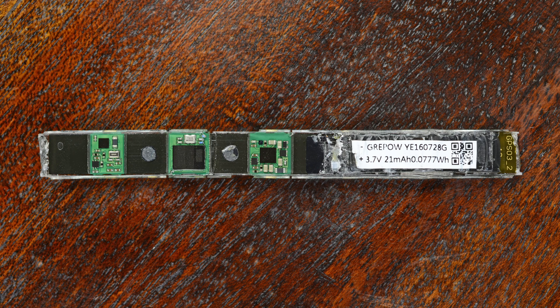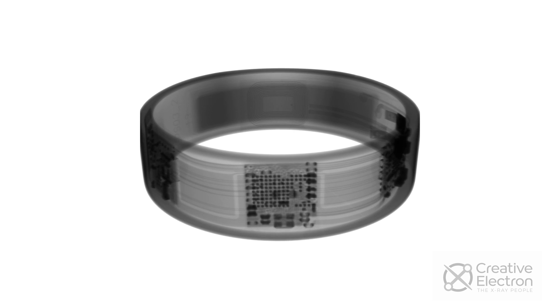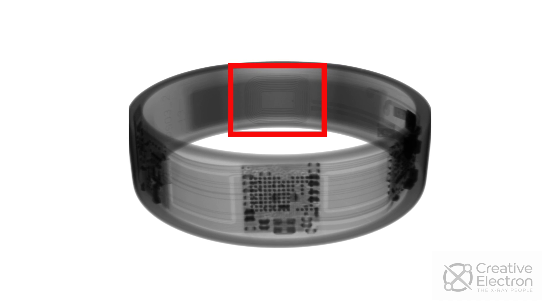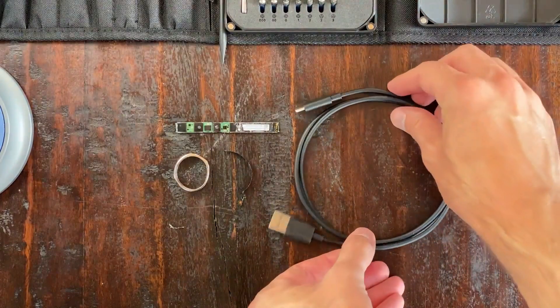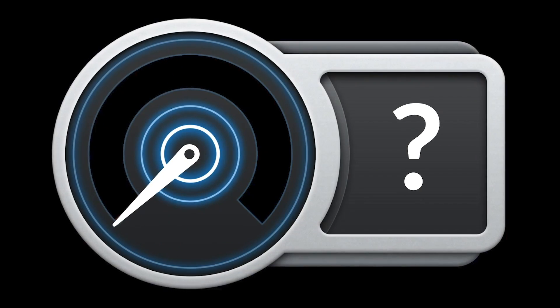On the hidden back side, we've got one Cypress PSoC 6 ultra low-power dual-core microcontroller with built-in Bluetooth Low Energy connectivity, one Texas Instruments low-current battery management chip, and several extra tiny unmarked chips — give us a shout if you've got any intel on those. You might still be wondering how you charge the battery in this thing. We can't see it in our teardown, but that's where those x-rays from Creative Electron come in really handy, because sitting just underneath the battery is a paper-thin inductive charging coil. It charges wirelessly, so you just have to get it close to the matching charge coil on the charging dock, which you can see in another x-ray right here. What can we say about repairability? Well, this definitely doesn't seem designed to be serviced. If we were to give it a repairability score, it would be low, but this is the first smart ring teardown we've ever done, and we haven't even developed a rubric for smart rings yet, so maybe I'll punt on the score for now.